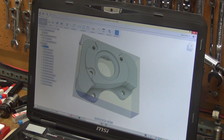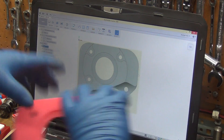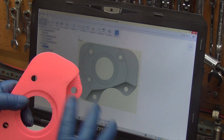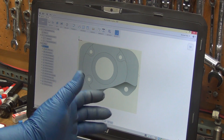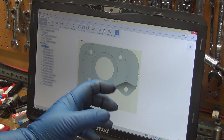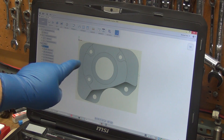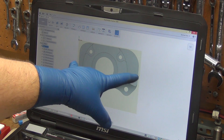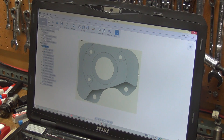It's going to be cutting some air on the sides because this particular piece is a hair smaller than the seven-and-a-half-inch stock. I got rid of that rise right here and shortened this up just a hair — because even though seven and a half goes into 60 inches evenly, you have the kerf width of the bandsaw. When I got down to the last two pieces they came up just a little bit shy — seven and three-eighths instead of seven and a half — and I was only pushing about 20 thou at each side, so I went ahead and shortened it up.